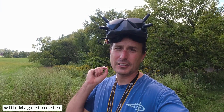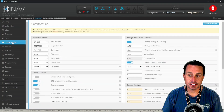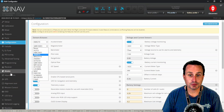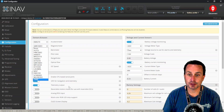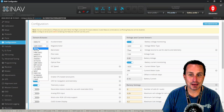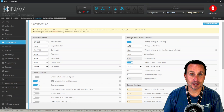Let's turn off the magnetometer and see what we get. To adjust the magnetometer settings, go to the configuration tab. If you don't have a magnetometer, by default this would be set to none because auto won't detect anything. To set up your modes in release 7.1, set this to 'fake,' hit save and reboot, and then you can set up your navigation modes. When you're done, set this back to none. I'm going to send this to none here, which will effectively turn off my magnetometer.